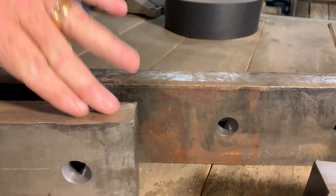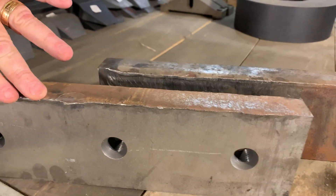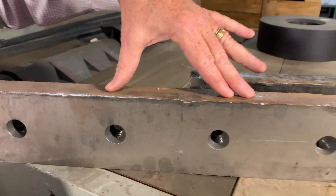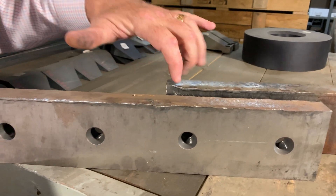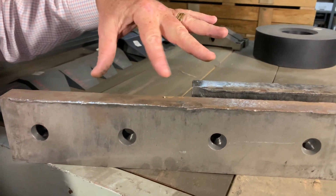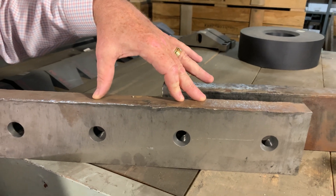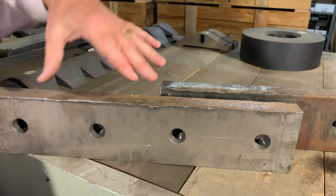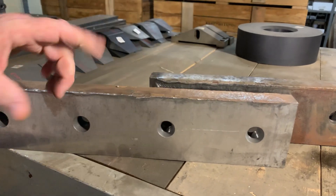This will not only limit your capacity for shearing in some ways because it's putting a lot more pressure on the whole assembly, but you're not going to get very clean cuts. One interesting stat: if you are shearing a single piece of number five bar, that requires a pressure of eighteen thousand five hundred pounds. Think about what that's doing to that entire assembly if you're trying to cut a whole conveyor full of these on a dull shear blade. So it's really important that we rotate these blades.